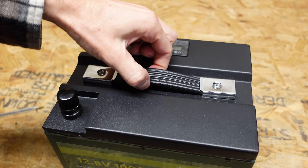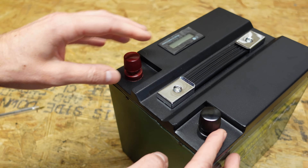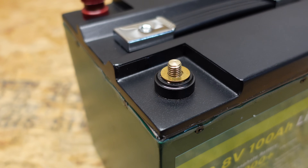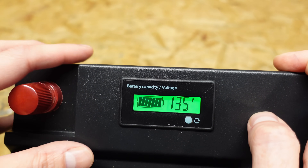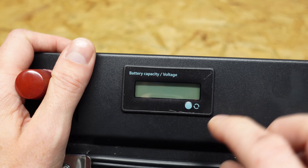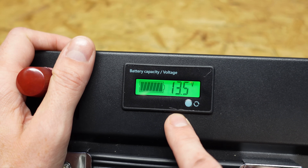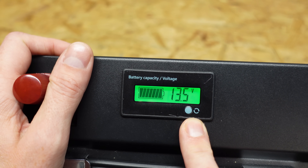The handle on top is pretty much identical to the handle on the SOK battery enclosure. On the left-hand side, we have two battery posts for positive and negative — the somewhat standard thumb screw seen on many cheaper batteries, which looks like an M8 bolt. On the top there's a battery capacity voltage display showing 13.5 volts. I did already charge this battery before the video — it shipped at around 30% state of charge as required by shipping regulations. However, these voltage displays are typically not driven by a shunt; they report capacity based on voltage alone, more suited for lead acid, so they're not a reliable state of charge indicator for lithium iron phosphate other than at 0% and 100%.